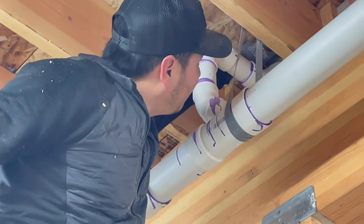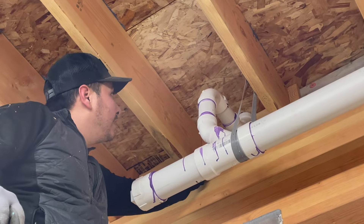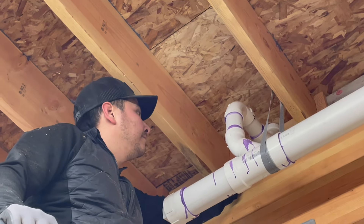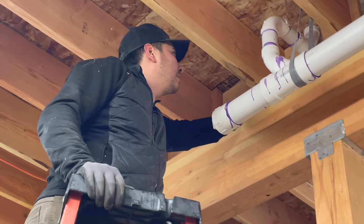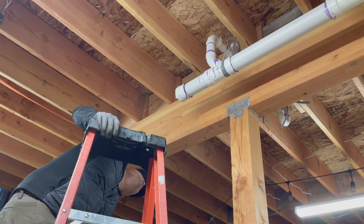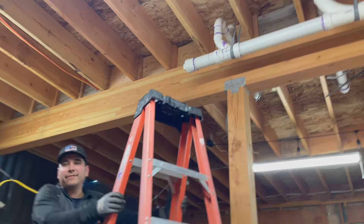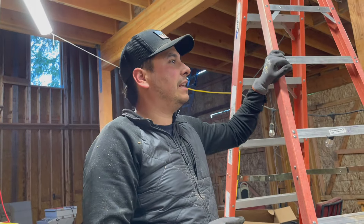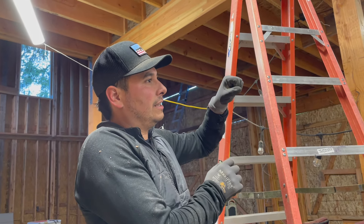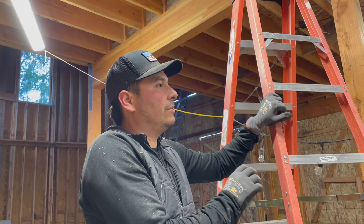It's coming from up top here — so basically I'm going to cut this right here, get a new fitting, and redo this vent line. We just returned all our extra fittings, and that's the shower one. I had a feeling because when I was twisting on the 90 that goes over, I accidentally twisted this and it twisted down below. We had just finished gluing that not long ago and that release right after gluing is all it takes.